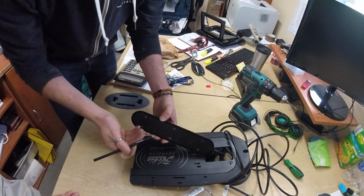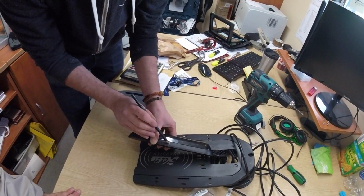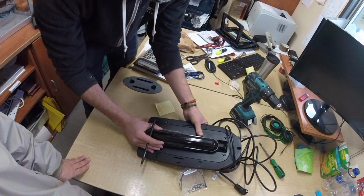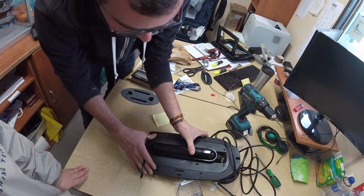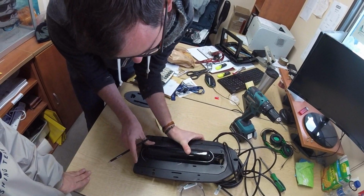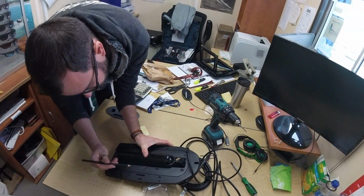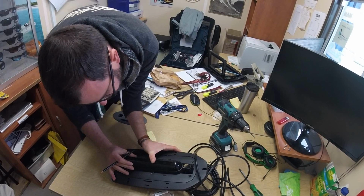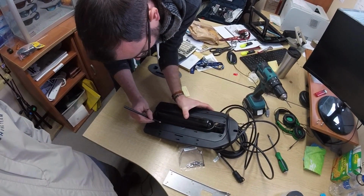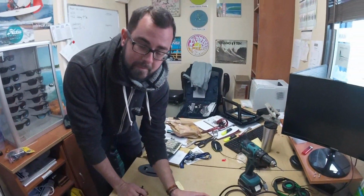So what we're quickly doing now is just transferring the centre hole lines onto the side of the transducer. So when we put the transducer over the trace line which we've drawn out on the outside, you can see exactly where the drill lines are, or the hole spacings are, so we can transfer. So when we put the plate on, we know exactly where the centre of the holes are going to be.